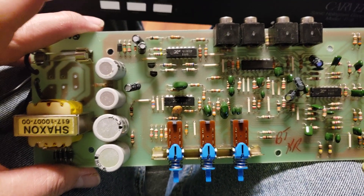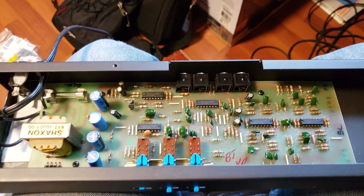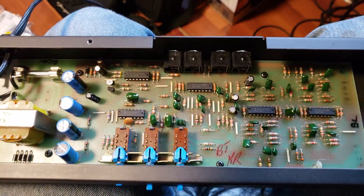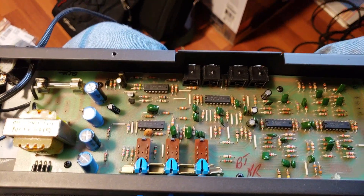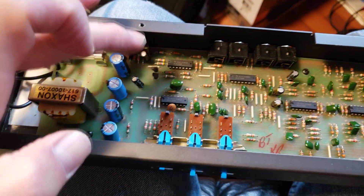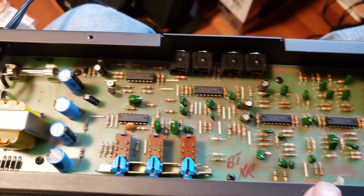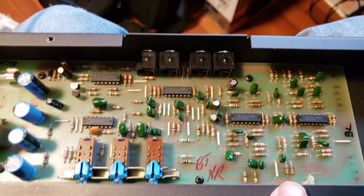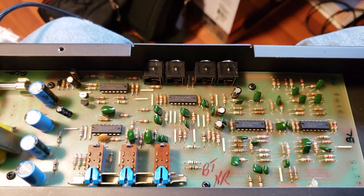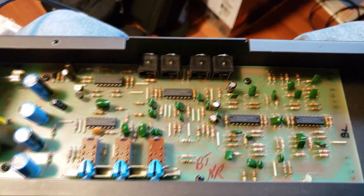It's the next day. I've pulled the board as you saw in the previous clip and changed out all the components. I did all the caps yesterday and put it down because it was getting late. I did all the op-amps this morning. I changed out all the canned caps you see there — not many of them, but enough. I did measure the ones that came out, and quite a few were out of tolerance — quite far out of tolerance — so I'm expecting good things.